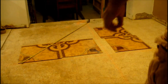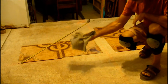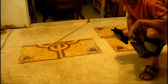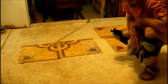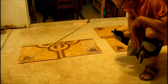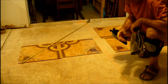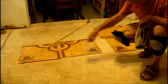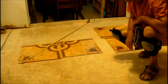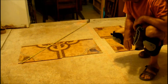I redid my chalk line, used a rag, wiped up the old chalk line, made a new one, and measured it again. I guess the room is straight. So back in 1964 they really knew how to build stuff and square things up. Today I would not give builders that much credit. But it looks like the 3-4-5 comes out just fine — three over here, four feet there — and when I mark them really well and get the tiles out of the way, it comes out to a nice 3-4-5. I might have been a little bit off on my tile alignment, observing an optical illusion.